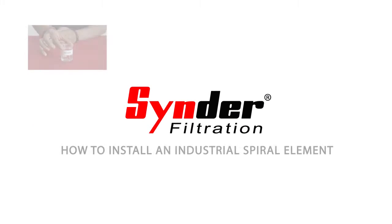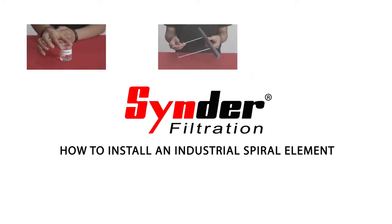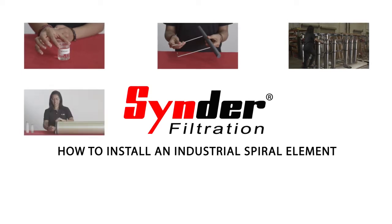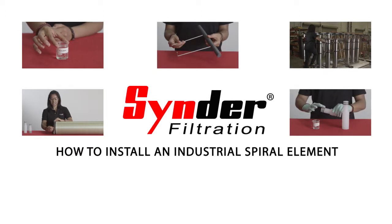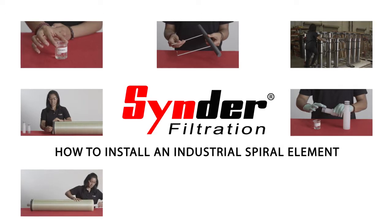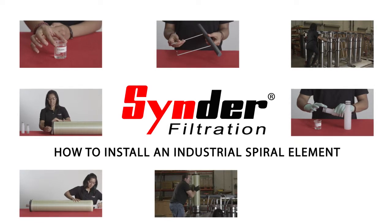Finally, let's install an industrial style element. Industrial elements commonly have a fiberglass reinforced hardshell outer wrap and integrated anti-telescoping devices with brine seals installed. The brine seals seal the outer diameter of the element with the inner diameter of the housing and force 100% of the feed flow through the element, creating a very efficient use of pump energy. This also causes a greater pressure difference between the exterior and interior of the element, and fiberglass is needed to reinforce the entire spiral element structure.